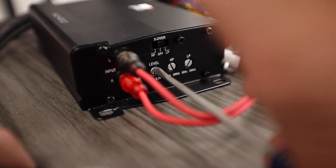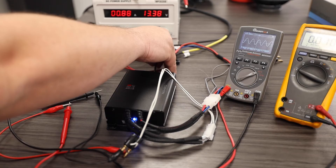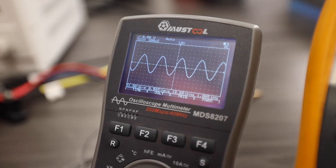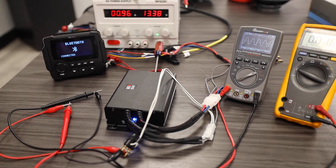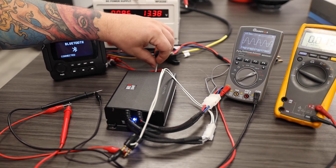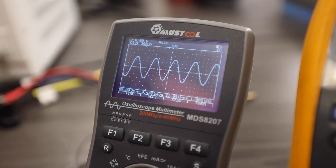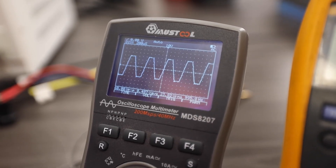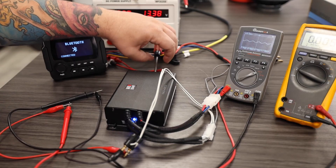If I come back to the back side of my amplifier and increase my level, you will see the wave get bigger and bigger and slowly start to square the top of the wave. This would be a clipped signal. This is a very good way to damage a speaker — you never want to have a clipped output signal. This is why adjusting an amplifier's gain properly is very important. With very little adjustment you can achieve the maximum output without clipping your signal and the potential of damaging your speakers.